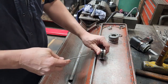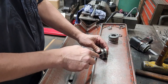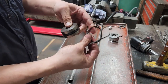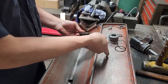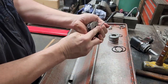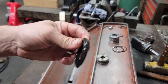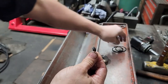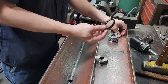Okay, there's that. This has what appears to be a TP-style piston seal — same measurements as an o-ring and backups. We'll take one of the backups off, and it is a split backup, so it is a TP seal. It's got two of those and then the seal itself. If this were cut, you'd see the profile — it's got these little edges, and when it's all together the extrusion rings go on the side like that. That's a TP piston seal.